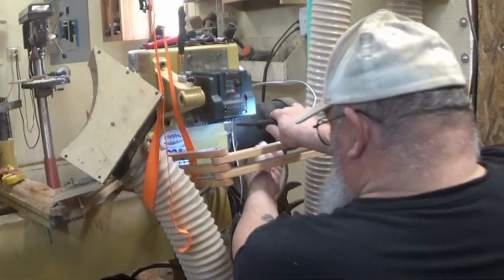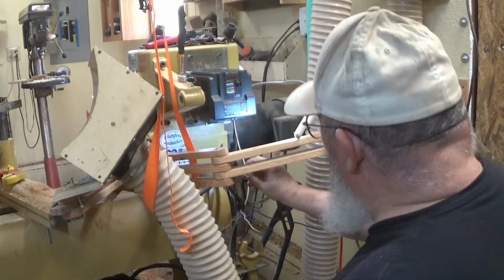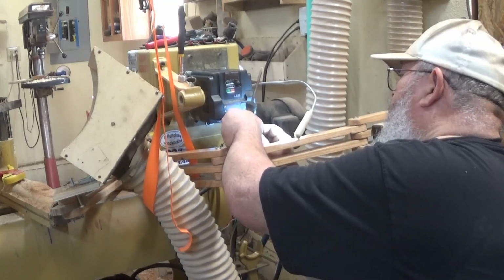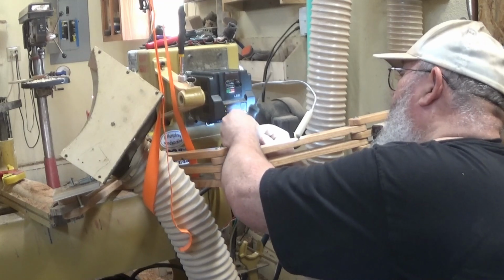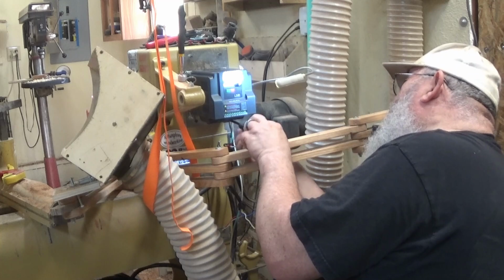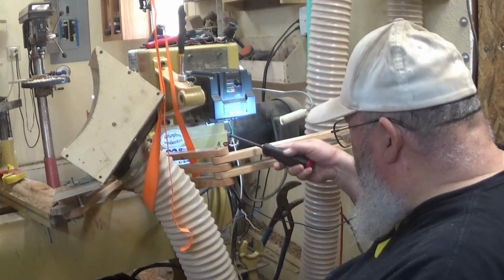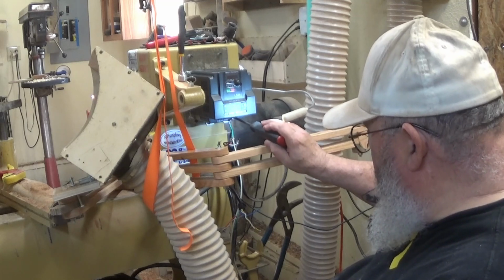Okay, I'm going to hook a couple of wires up. But first I'm going to hook the output to the motor up. This goes to the motor. So first things first, we'll hook up the ground. Getting these big nuts in tight places is not easy, and it's not that it's that tight. Got that done. T1, 2, and 3, that's these three here.